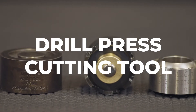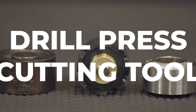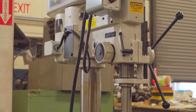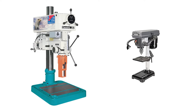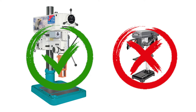The SMT Drill Press Cutting Tool is used for cutting the chamfer lip of an installed v-groove bearing in order to properly remove the bearing from a housing hole and allow reuse of the housing. It's important to use a heavy-duty drill press because it ensures enough force can be applied into the bearing without deflection in the drill press quill or column head. It is not meant to be used in a typical Harbor Freight or Hardware Store table-mounted drill press, as there is potential for damaging the tool, the bearing, or the housing due to the lack of rigidity, and you may not achieve the swedge required for aerospace standards.